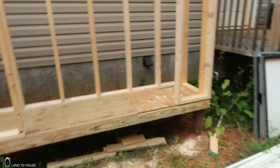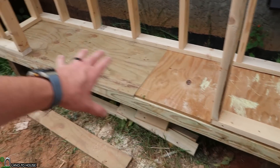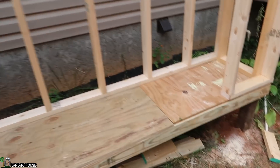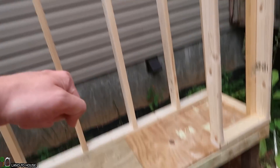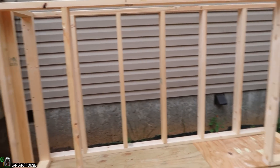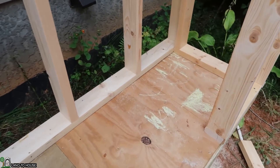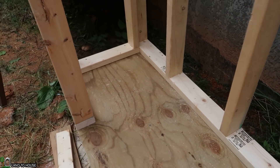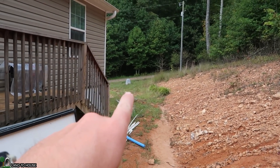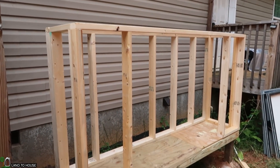I worked some more on this without you and got basic framing done. I put a little 18-inch front wall here and over here, and that will allow for the door to be five foot in between. I'm probably going to do a door that latches down here and then pulls up, sticking out five foot with a little kickstand to hold the door up. I was thinking I'll probably have to access this at some point in the rain, so it'd be nice to be able to step in without getting wet. Coming up next, I need to put the roof on. Right over here I've got some metal roofing I've been storing — I think this would be perfect. So the next steps are the roof, the door, and the siding.